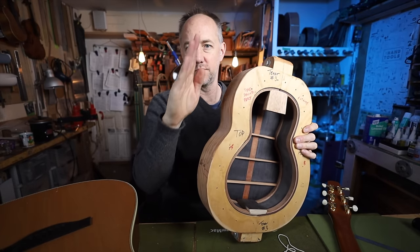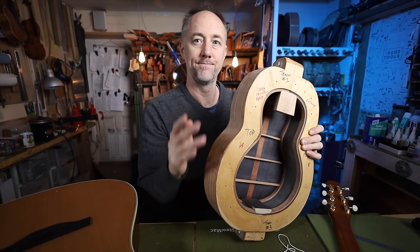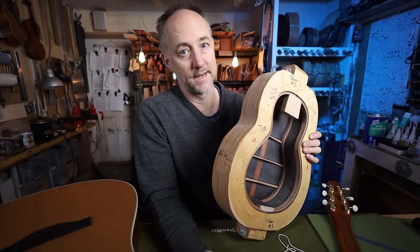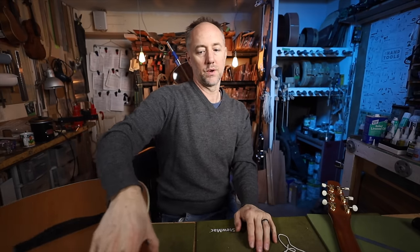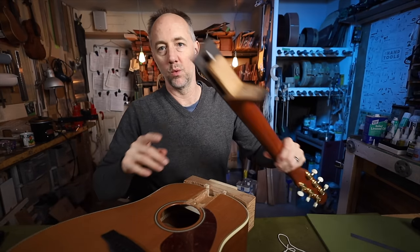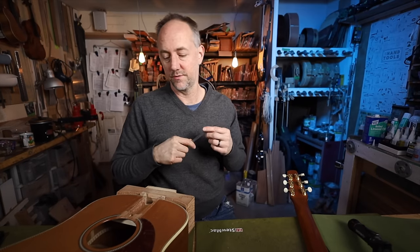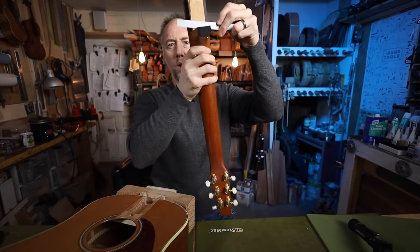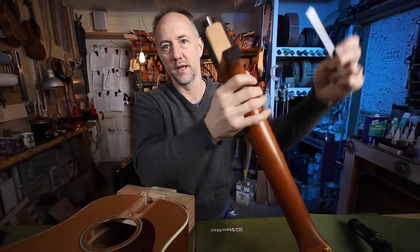If it's crossing over a few grain lines, then that's great. If it's running parallel with the grain line, you're gonna get cracks. That's just what happens. So just use a slightly wedged headblock extension or headblock, and it'll at least minimize this problem. Also, the headblock absolutely needs to be wider than the fingerboard. Let's measure it. The headblock itself is 4 inches wide, which is good. That is that wide. So plenty of space. It's like 2 inches or an inch on either side.